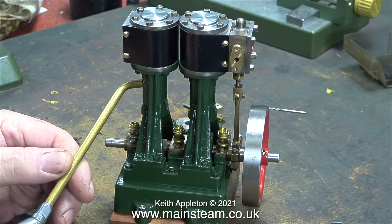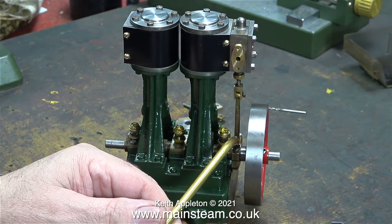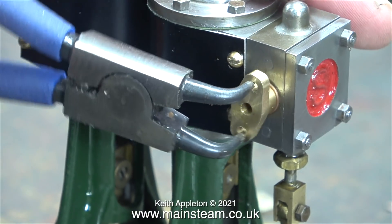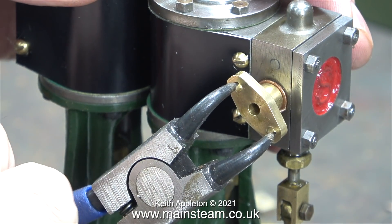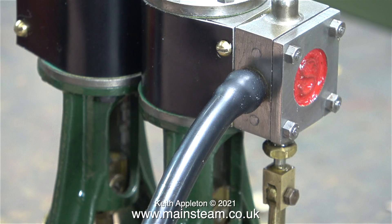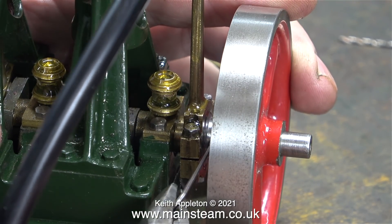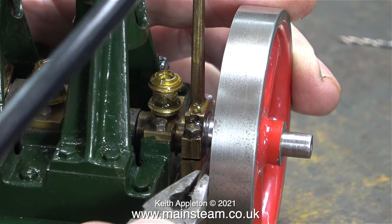You will notice that I only applied oil onto the top of the cross heads. Gravity does the rest — the oil runs down both of the connecting rods to lubricate the big ends. Temporarily using a pair of circlip pliers and removing the inlet flange. As a convenient way of testing the engine without bolting anything to the flanges, I've fitted this quarter by 40 double union. It's the wrong thread, so it won't screw in very far, but it goes in far enough. The brass will not damage the cast iron thread, and I'm only screwing it in a couple of threads anyway, so there's no problem. There is another bonus of using the centre part of a double union for this job — I can push the piece of silicone rubber tubing over the hexagon part to hold it in place. I'm just using a pair of pliers to tighten the allen key in the grub screw that holds the eccentric sheave in place.